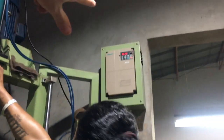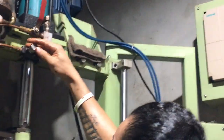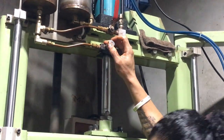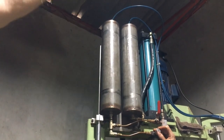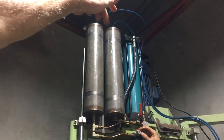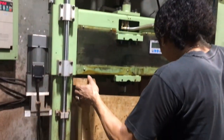The VFD up top — that's a variable frequency drive — that's how we control our RPM. The flow control that Jojo is turning right now is controlling the feed rate. It's air-oil hydraulics, uses a little tiny compressor like this, and we put pressure on the hydraulic fluid in these cylinders. In this case it's in the right-hand cylinder because we're pushing the ram down, and we're controlling the flow out of the cylinder until we're engaged with the rock.